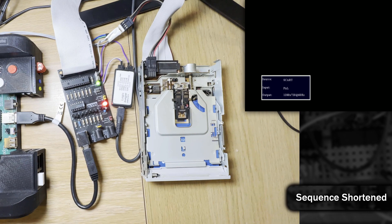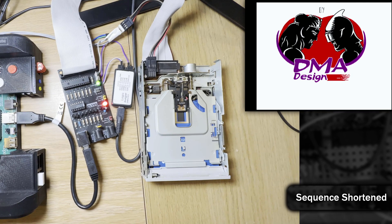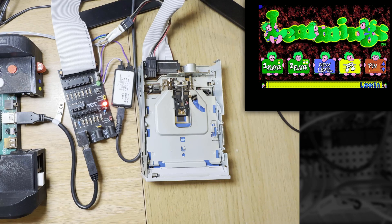After a lot of debugging, I finally managed to implement the missing fields correctly, and Lemmings booted too. I ended up using WinUAE as a reference for what happens to this register during load, and monitored it to make sure it was behaving the same. The thing I really like is that the drive sounds exactly how it does on the real Amiga when a game is loading. This change to the register is currently only for external real disks, not for ADFs.